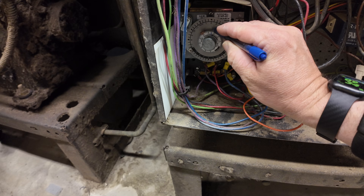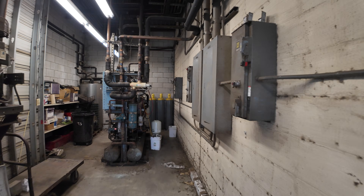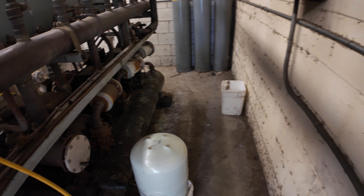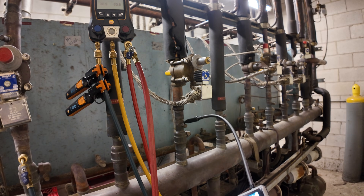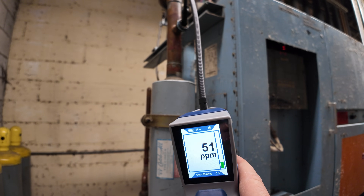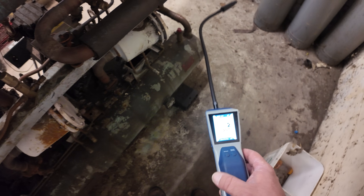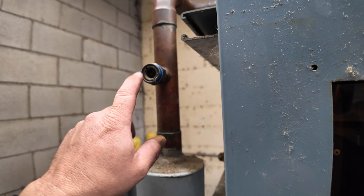The audio is really bad in this area. Moving on to the rack system — the customer complaint was that the system is low on refrigerant with some small leaks. We're going to search it over and find several smaller leaks, which all add up. He decided to just go ahead and add 25 pounds of refrigerant. Budgets are tight on this job so we're being very conservative on money spent. We're finding some leaks on the receiver level indicator — you'd have to recover the whole system to change that seal — and the same thing with some items over here, including a couple isolation valves and a sight glass.